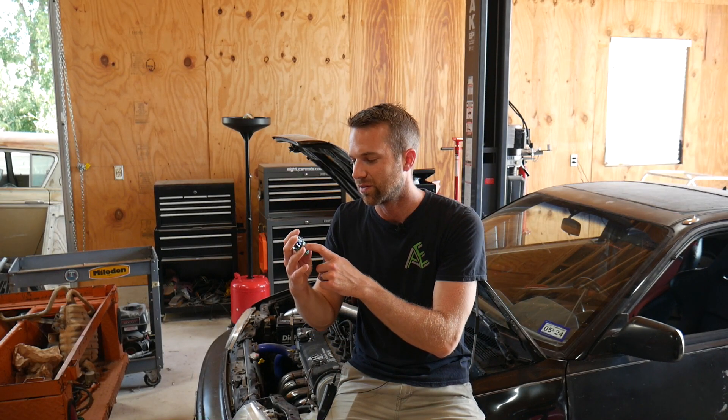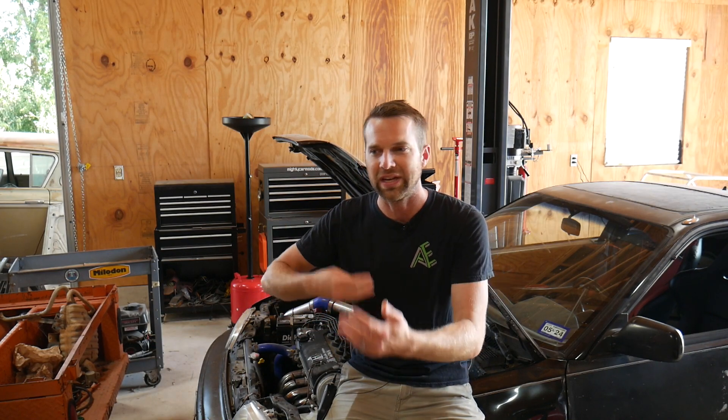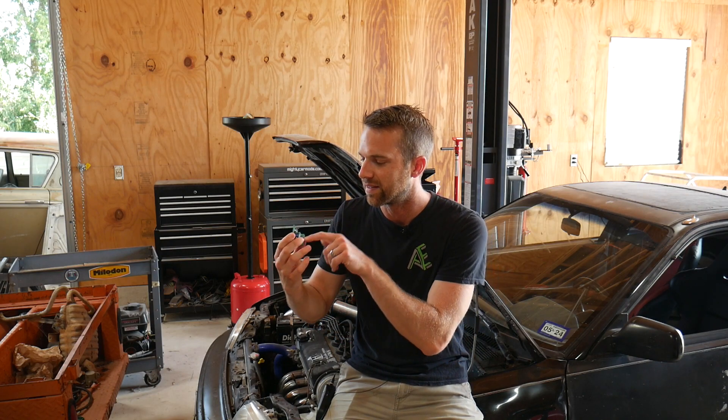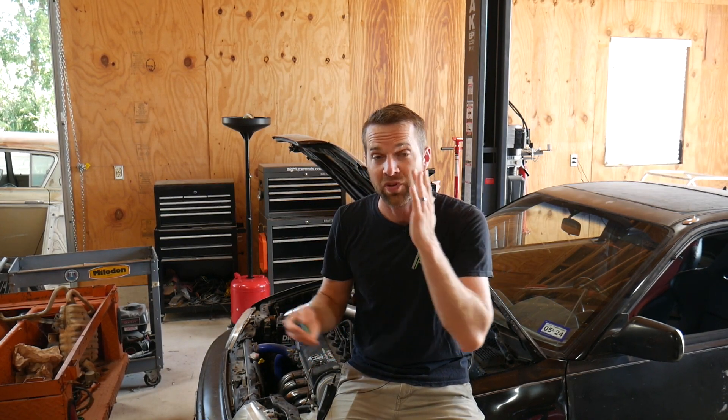Really, I need one that covers 0 to 1,600 hertz, but the next step up is 3,000 hertz. And the 3,000 hertz one doesn't start seeing any actual RPM ever — not within the range from 0 all the way to 7,000 RPM. So I basically hit a wall. I tried pairing a 0 to 1,000 hertz one with a 0 to 3,000 hertz one. I tried a 0 to 10 volt version at 0 to 3,000 hertz, hoping the 0 to 5 volt part of the signal would cover 0 to 1,500 hertz. None of that worked — not a single bit of it.